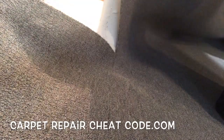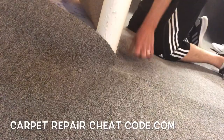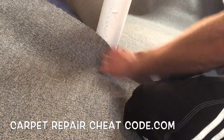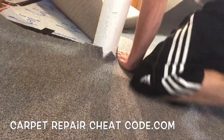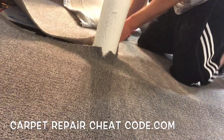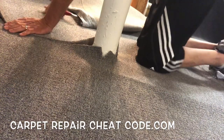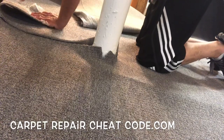As you've seen there we made a nice slice right around the pole and we're going to slowly wrap it around. A couple key things: we're working with indoor outdoor carpet. You need a super sharp blade. Do not be afraid to change that blade out a few times in the process, because if you get any snags or stringies it's not going to seam up nice. As we work around the pole we're just going to cut little slits, little relief cuts all around it, and I'm going to show you what happens when you mess up too.